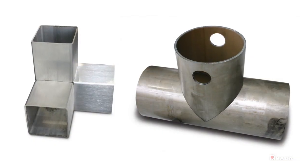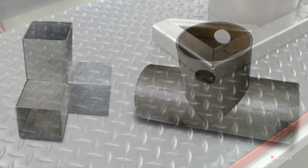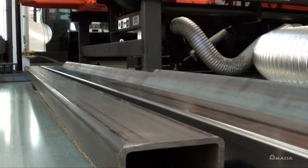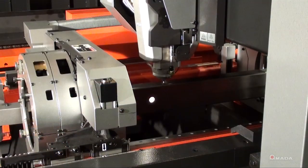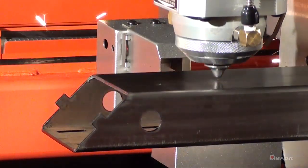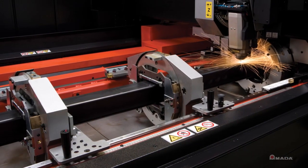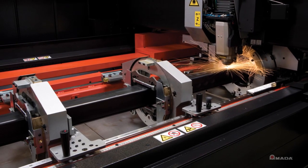The rotary side of the machine has the capability to cut round, square, and rectangle tubing as well as angle iron and C-channel. The RI can hold a 20-foot piece of tubing and will automatically reposition to produce parts up to 19 feet long. The ability to hold and cut rectangular and C-channel material sets this machine apart within the industry, using independent jaws to hold different sizes of tubing and channel, thus expanding a shop's cutting capabilities.